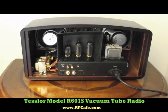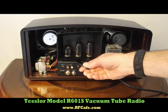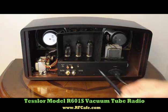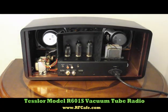It's a relatively new model that has a fully solid-state receiver front end and tuner, and then it uses vacuum tubes on the output stage. It has a single 6N2 vacuum tube here for the pre-amplifier, and then the right and left channel output amplifiers that drive these nice heavy-duty speakers are 6P1s.